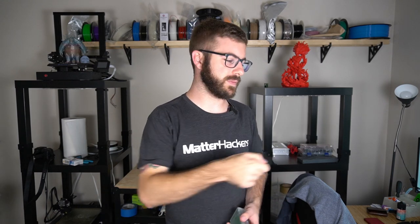OctoPrint is something that you can install onto a Raspberry Pi or a similar board. It basically acts as a wireless controller between your computer and a Raspberry Pi that is then linked via USB to your printer. I've been using this for years to avoid running back and forth with a flash drive or micro SD card, to monitor multiple printers, and to avoid USB cables running. And if Windows were to restart, OctoPrint is still running and my print will turn out fine.